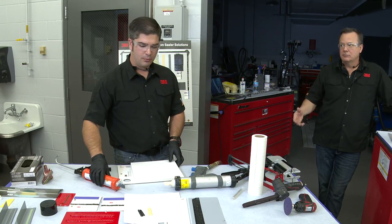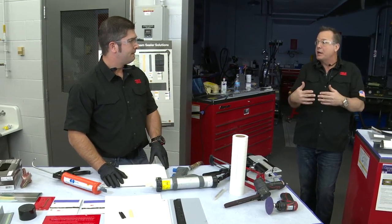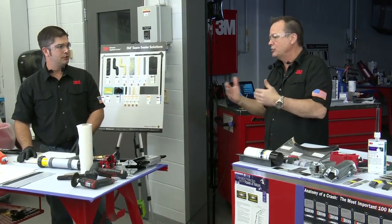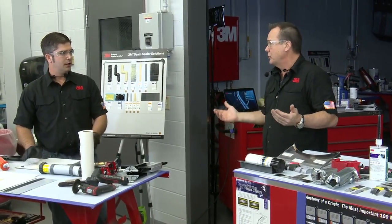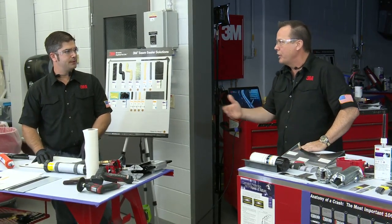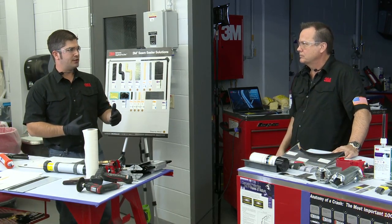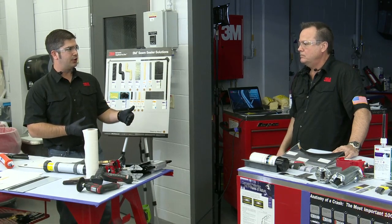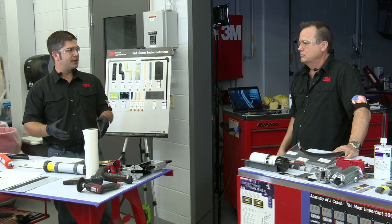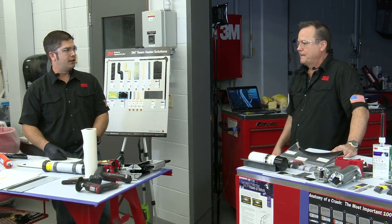But I always think of areas like if you put a couple quarter panels and a rear body on a vehicle, all that stuff on the inside that you need to seam seal, why use a 2-part cartridge when you could use a 1K? It's much cheaper for one thing, and you're not really worried about it curing immediately. And if we're actually following the OE process of how we're applying our seam sealers to really achieve that factory look, we'd be putting them over a 2K factory match sealer to begin with, and then you can use your 1K, let the overspray fall inside the car, and sort of replicate that.